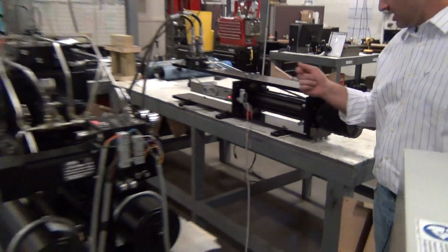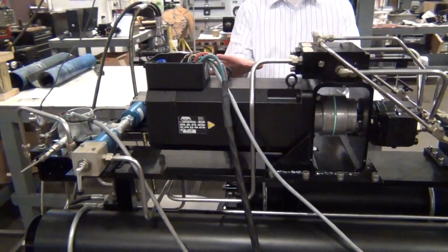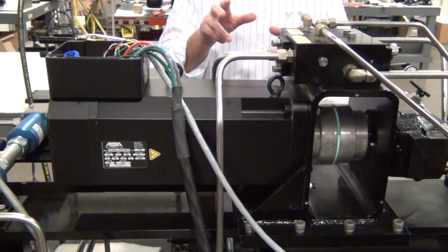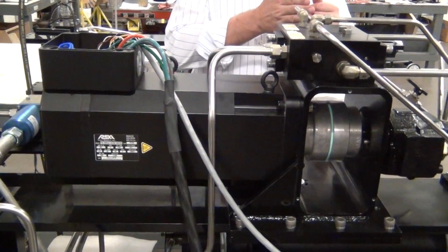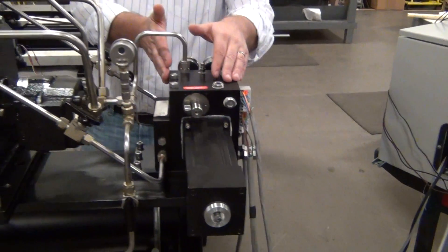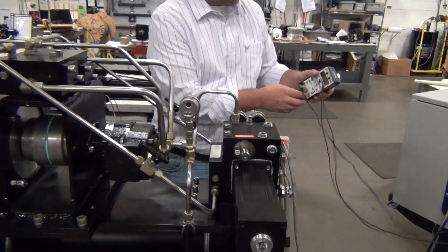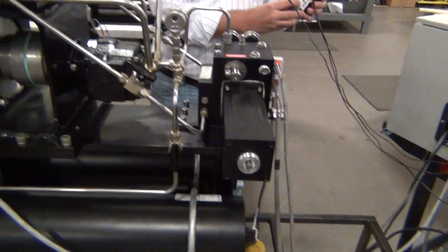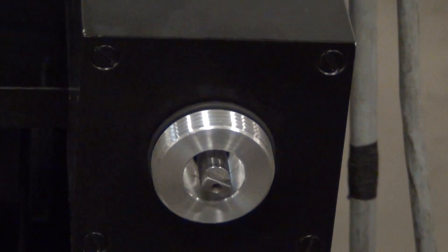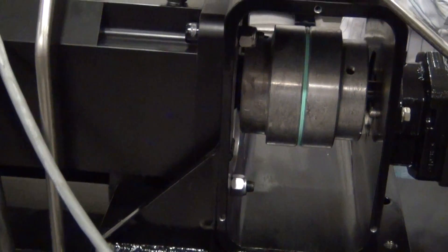This is what the system looks like hydraulically — there is no oil tank. All we have is a large booster motor that activates for large set point changes. If I make a signal greater than my booster pump setting, this motor and pump activates. When I get close to target position, this motor and pump stops. We also have a smaller motor and pump used for small set point changes and very fine positioning. If I make a small set point change, only this motor activates; if I exceed the break point setting, the large motor activates.